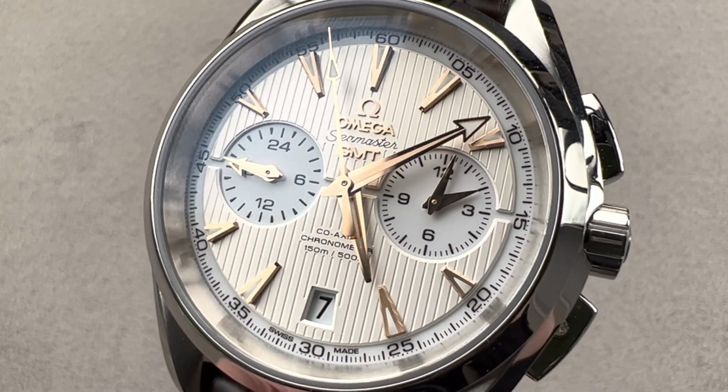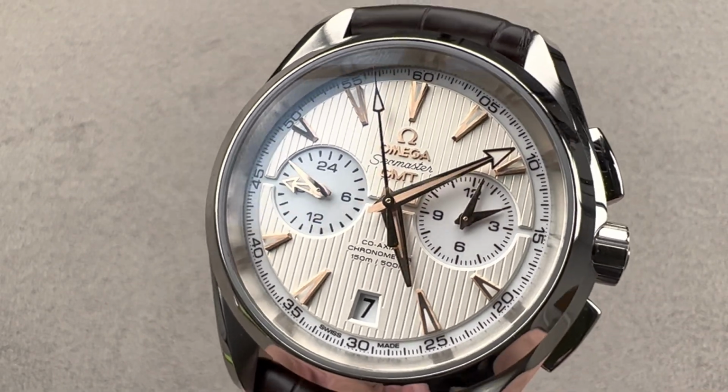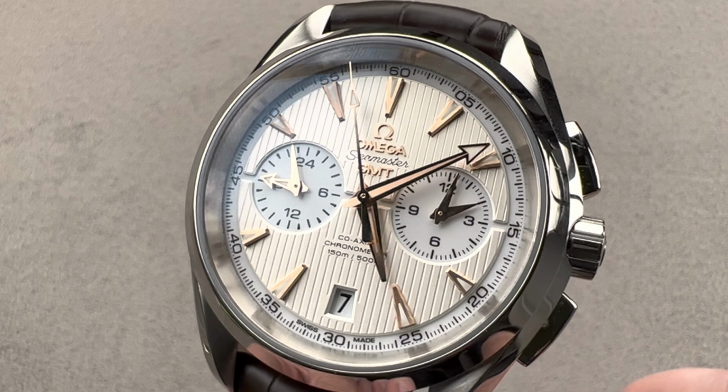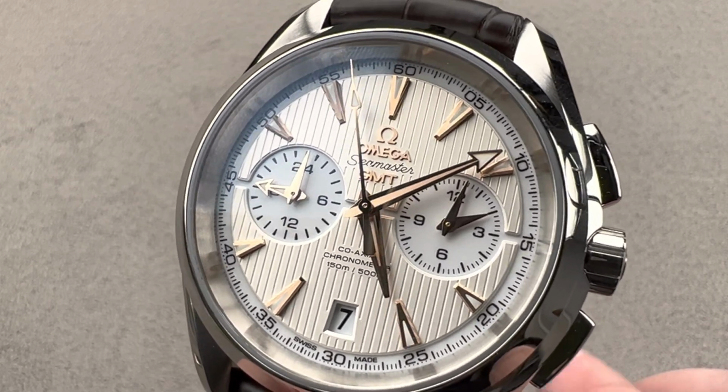Oh, I thought of 2 more things you should know. First, double barrel movement. Omega's premium movements always have the double barrel. Gives you a 60-hour power reserve, but it also evens out the torque release from the mainspring so it doesn't gallop when fully wound or lose a lot of time and amplitude after 18, 24, 36 hours.